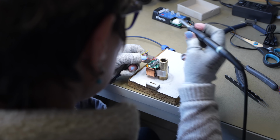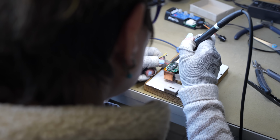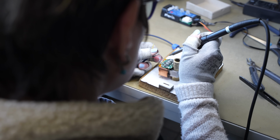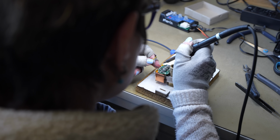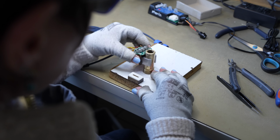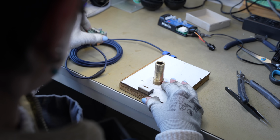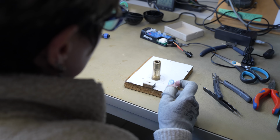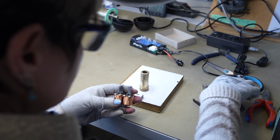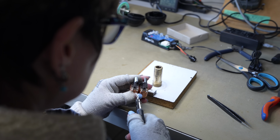You can see here 3 wires. Maybe you know the flag where the colors came from. It's really an Easter egg that we integrated. At the same time we have a plus, a minus and a signal wire. And the signal wire simply understands an analog input signal. So in theory, you could also use this pump for other purposes or plug it into other controllers. A lot of competing pumps can't do that.